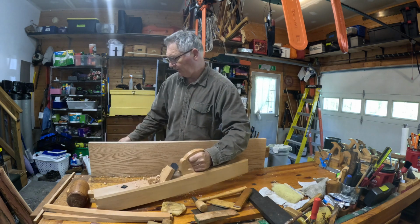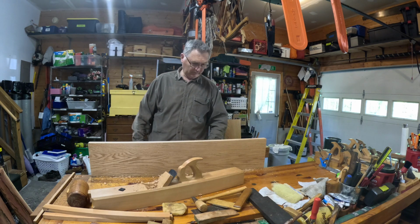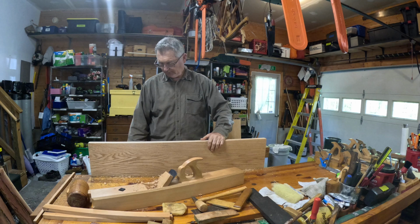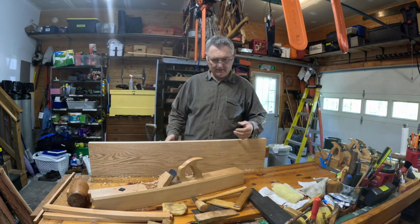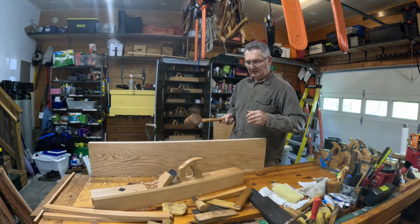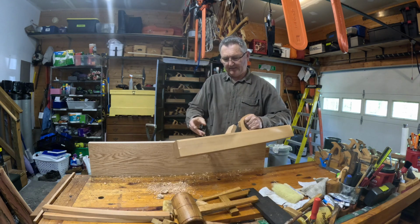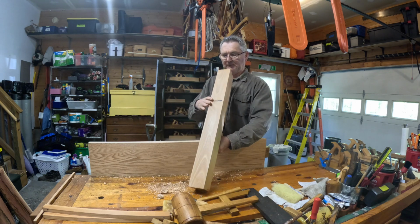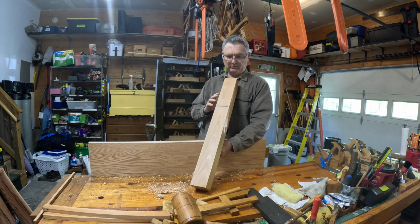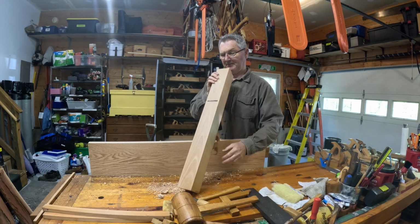So the way I have this board fixed, it's very rigidly fixed. Like I said in the previous video, I've got an apron board on the front of my workbench, and it's got some dog holes. So there's some iron dogs. I'm just holding it. Sometimes you have to tighten that up, but it'll hold it pretty well. With a metal plane, you've got your lever, you could throw the blade out of square. You could do the same thing with a wooden plane. Just easily tap it.